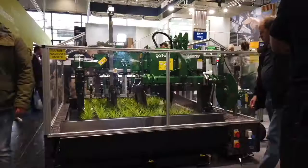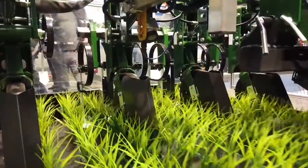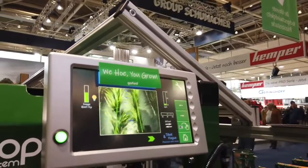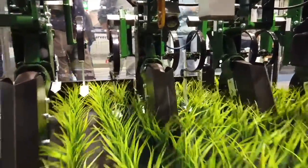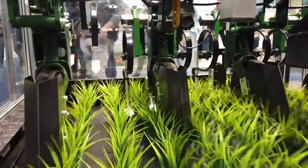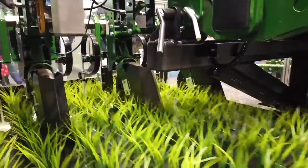So explain what's happening behind us in terms of mechanical weed control — it's a new age of it. This is a Garford Robocrop Guided Hoe. The information goes through to the camera, through to the console, and is transferred through the side shift into mechanical movement between the crops. The camera looks out at the rows — some rows are straight and some are not — and we don't want to till up the crop. We're looking about a metre to a metre and a half in front of the crop, as long as we can see a minimum of three rows. Sometimes the hoe is on the front of the tractor; sometimes we'll put the machine further back so the camera has vision of the crop.